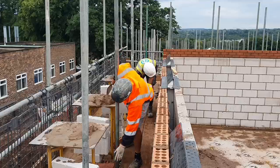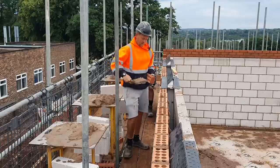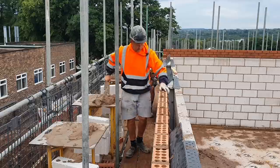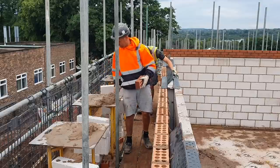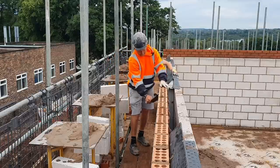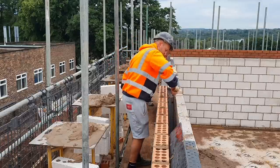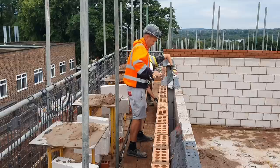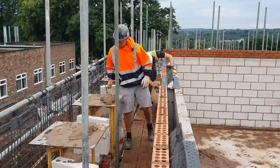I know that on my house, there's no detail at the top, over the through, and some of the brickwork's been pushed when I've been up and had a look. I'm gonna have to repair that when I do my soffits and fascias. You can see now how the bricks just fly through.